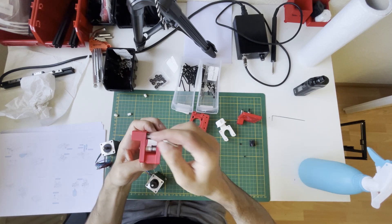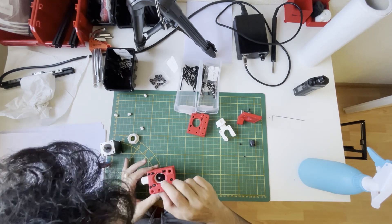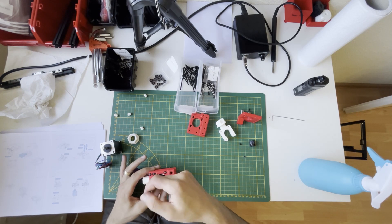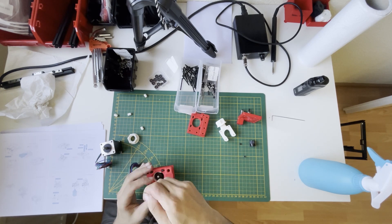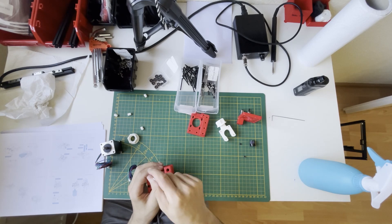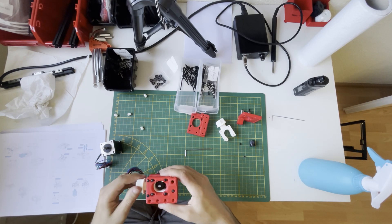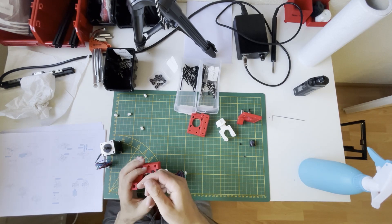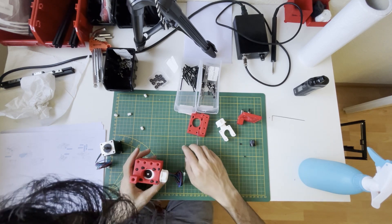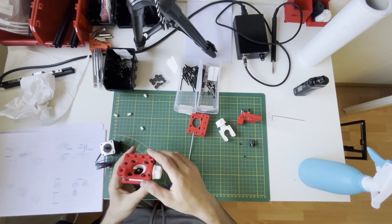For now I will just put the pulley and do the final adjustment once it is installed. I can access via here to align. I'm not tightening the screws that much — I'm leaving them slightly loose. Because if I tighten them I cannot properly use the belt tension, as this will function like a belt tensioner.